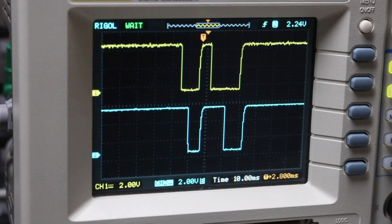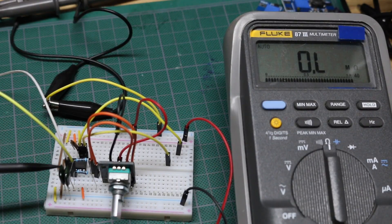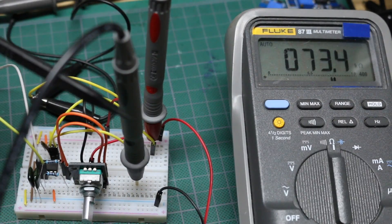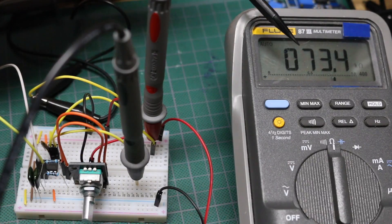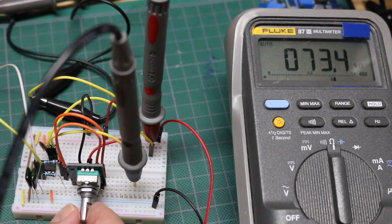That's roughly how I would go about putting together a quick circuit to directly hook up a digital pot to a rotary encoder and be reasonably sure everything looks good. I wouldn't necessarily design this for production, but on the bench it works. Here's the final circuit with the digital potentiometer and the rotary encoder — the debounce circuit including the 100 ohm series resistors to limit current through the switches to about 50 milliamps. Resistance should go up when I go clockwise and down when I go counterclockwise, and with the debouncing it should be relatively smooth. I powered up at 73k from wiper to resistor low.